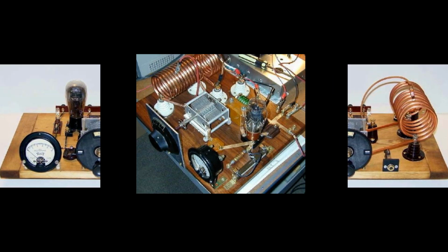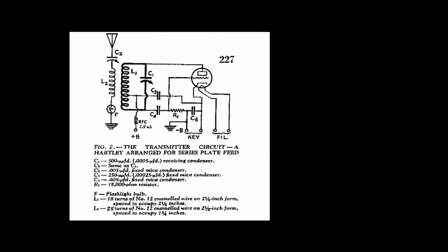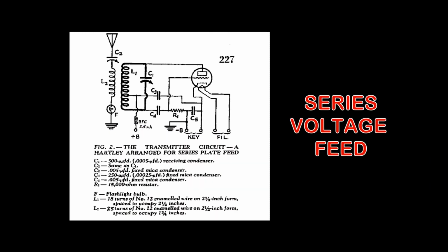Because a high Q resonator requires less driving power than a corresponding low Q resonator, its frequency is less affected by a given fractional change in the driver system. Tube circuits won't affect a high Q circuit compared to a low Q circuit. The series circuit shown is the simplest implementation, and it's still quite popular in radio design.